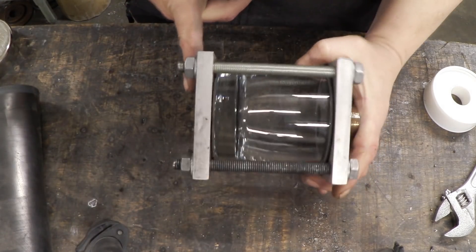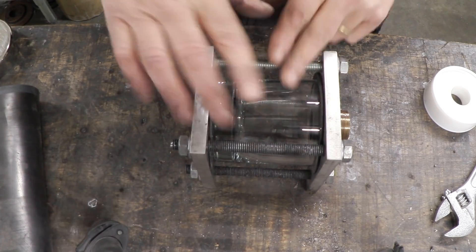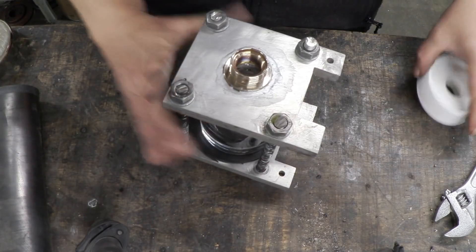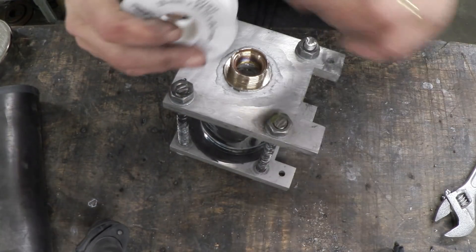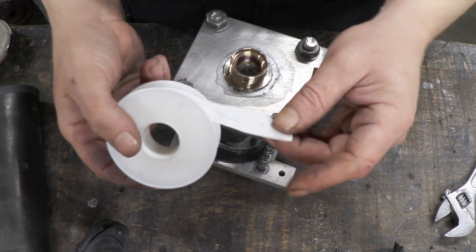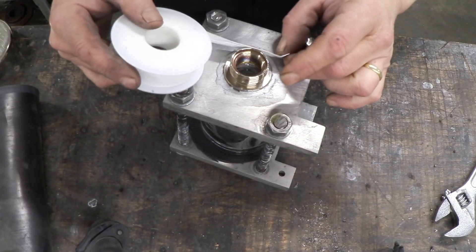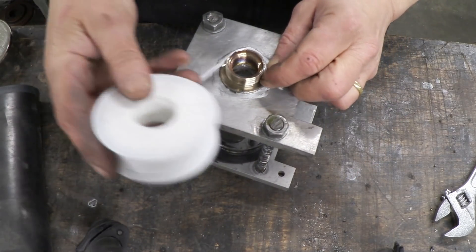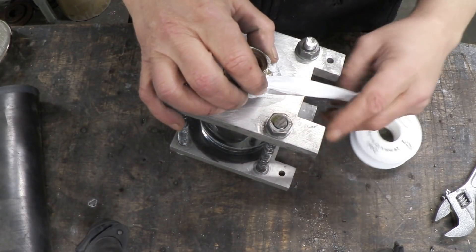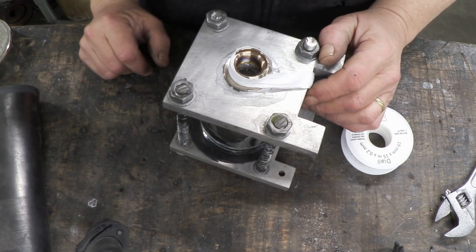Be careful not to over-tighten the bolts — we just want to put a little bit of pressure on the rubber to ensure a seal. We also have another joint here which is a threaded joint. For that threaded joint we need some joint tape. This stuff is PTFE, often used in gas lines and water lines for threaded joints. It's good to about 300 degrees centigrade, which is probably about right here. We wind the thread tape with the thread and screw that back in to make a good seal there.